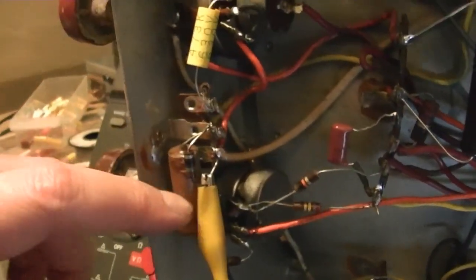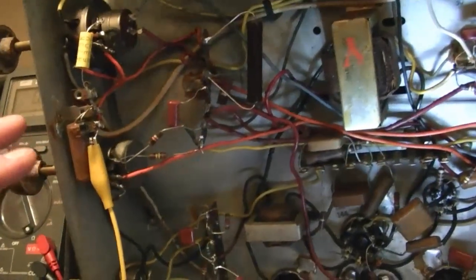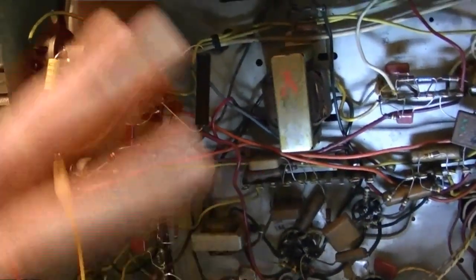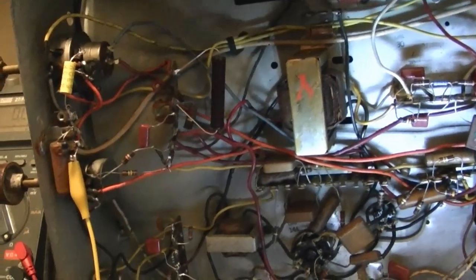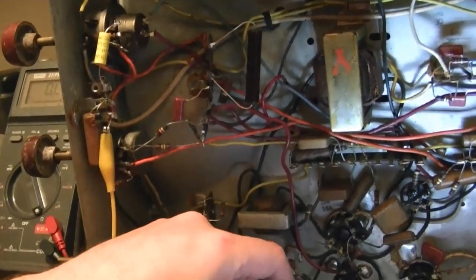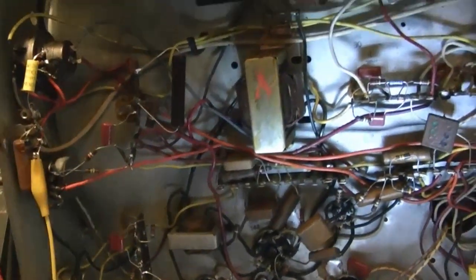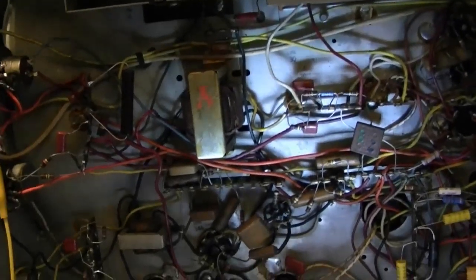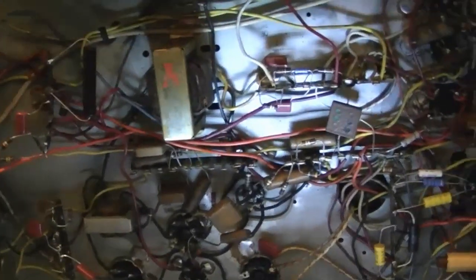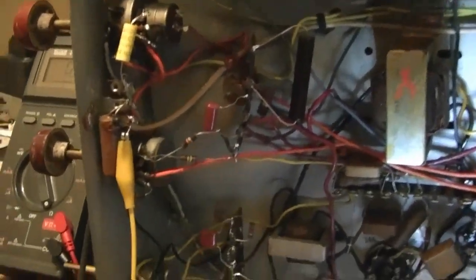Right now I'm working on the volume control, replacing some of the old paper caps. I'm pausing to check some of the resistors. I'd already spot-checked a few early on just to size up how all these resistors held up over time. Usually you take a random sampling and if they're all pretty good, it's a fair bet that the majority are going to be alright. But if you spot-check a bunch and they're all off, the odds are pretty good that a lot of them are going to be off. Well, in this case, a lot of them are off.